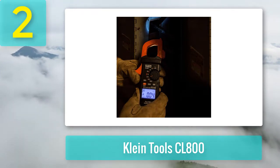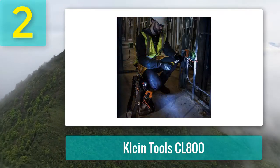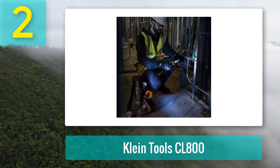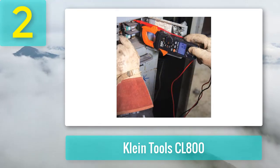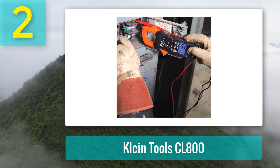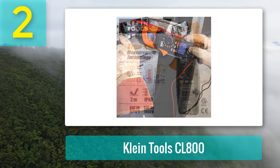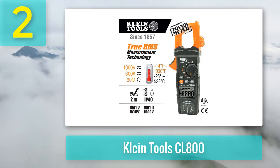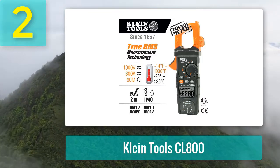Another similarity with the top clamp multimeter is true RMS technology. From our tests, almost all measures are accurate except for the thermocouple readings. That is why it ranks second rather than first. A difference from Fluke is a reverse LCD, which is helpful when working in a low-light environment — all readings are still apparent. Pros: Cheaper than expected from all features. Compatible with various AC and DC currents. True RMS technology supported. A user-friendly reverse contrast LCD. CAT 3, Class 2, and double insulation rating. Cons: Slow continuity tests. Inaccurate thermocouple readings.